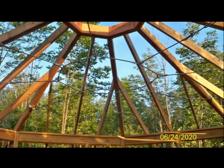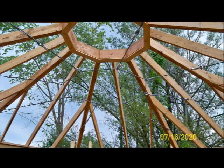It took a lot of finagling to get the center circle to become a regular eight-sided polygon. First I had to equally space each harness section, then, tightening and loosening the turnbuckles as necessary, I got all eight angles to be equal. It took quite a number of trips up and down the ladder to get it just right. And this is the end result.